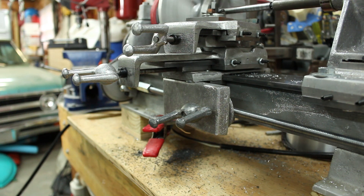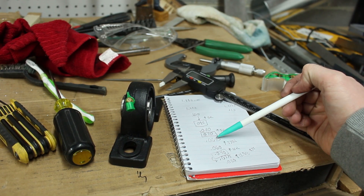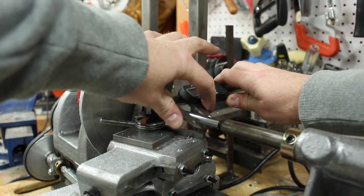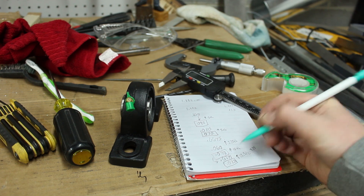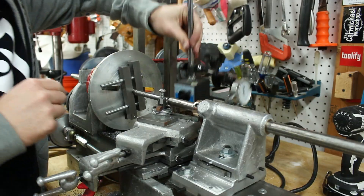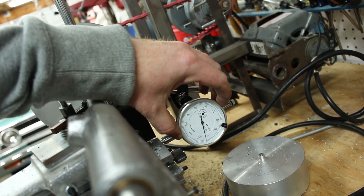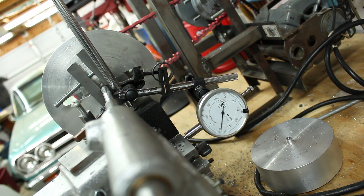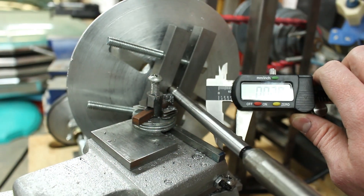I like to keep track of the different measurements as I'm turning down a piece. When I'm trying to approach something like 3 eighths of an inch I set my calipers to show me the difference and then I write down a target of where I want to get — in this case it was 20 thousandths over 3 eighths. I adjusted the cross slide in by about 9 thousandths and that got me pretty close to 20 thousandths over, so I continued that down to 3 eighths.